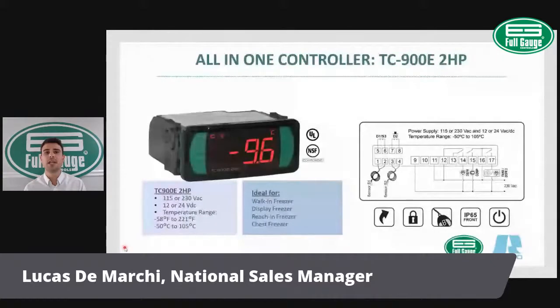So we're going to be looking at how to install this control to replace a mechanical thermostat, a defrost timer, a fan termination switch, as well as the temperature indicator, the thermometer. So with this digital temperature control, you can actually replace your thermostat, defrost timer, and thermometer, all with one single digital control.